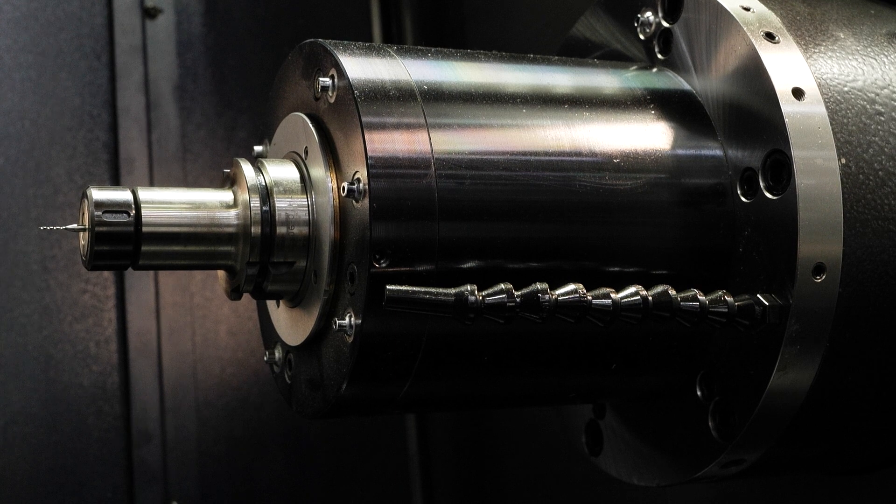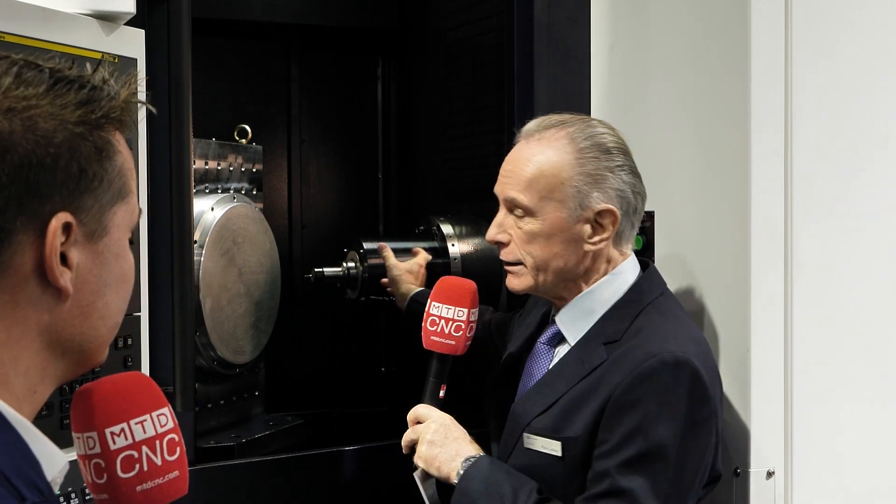This spindle has been specially designed to cater for all these demands. We are using more bearings in the spindle. In fact, the spindle nose has practically a package of four bearings in front and another two in the back, making sure the whole spindle cartridge runs very smooth and safe. On top of that, we have our special oil jet lubrication system. Not only are we lubricating and cooling the bearings with this, but it is constantly done — at any given time, the bearings are not running in the same oil as two seconds ago. It's a constant circulation of fresh oil lubricating and cooling the bearings, which means you can run the spindle 24/7 at maximum RPM.